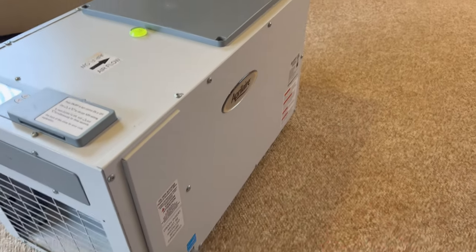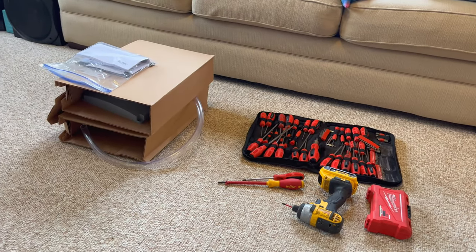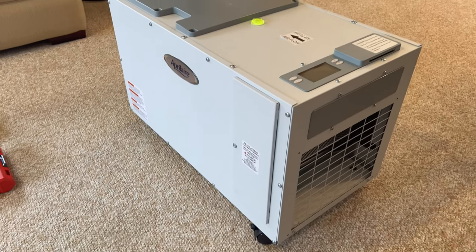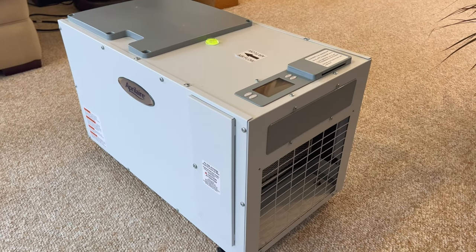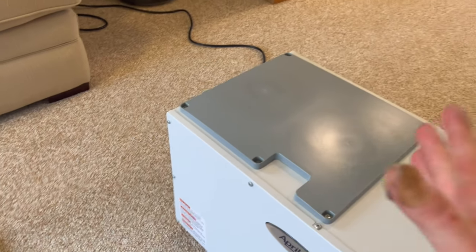There's nothing, everyone. Got the accessories here. Look like they're still in the box yet. I mean, obviously, I'm thinking someone maybe put them back in there. I don't know. But again, the unit powers up, everyone. The compressor runs. The compressor gets cold. But there's no air movement.